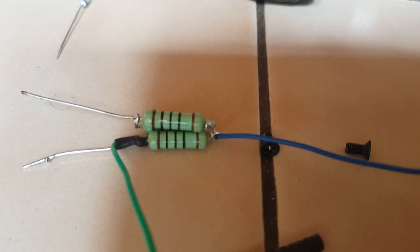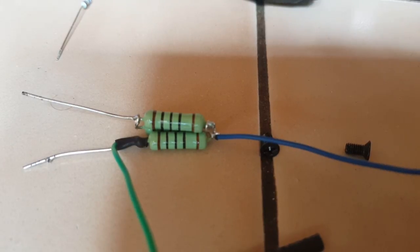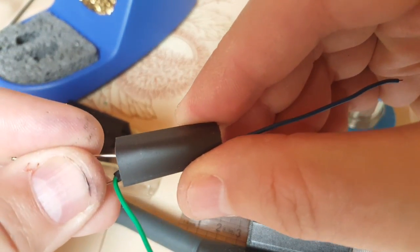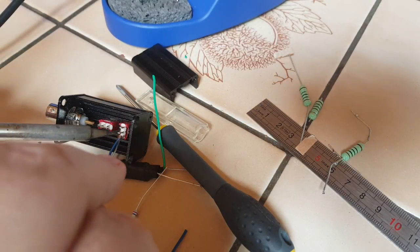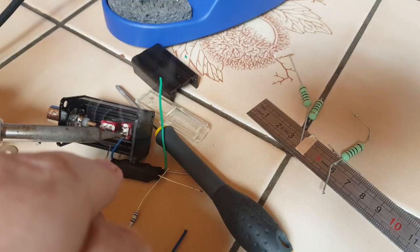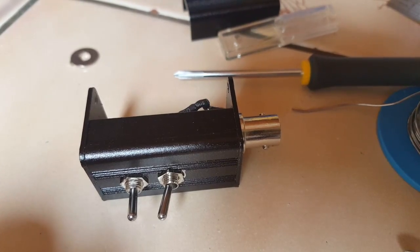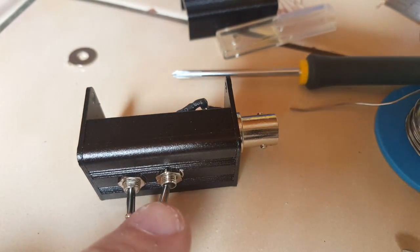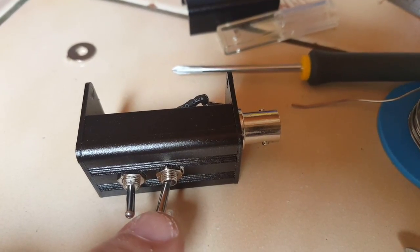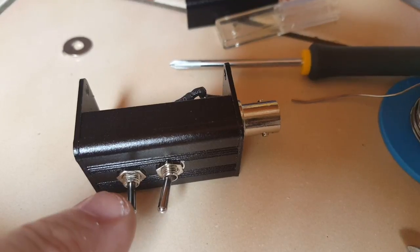Here's the whole bundle — the green and blue wires are to short the 100 ohm resistor and the two resistor leads are for the load. I'll use a little piece of heat shrink tubing to avoid shorts. The bottom switch will be used to switch between 150 and 50 ohms, and here's the finished product.